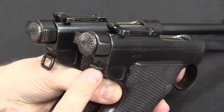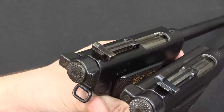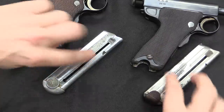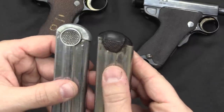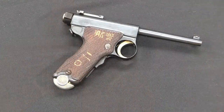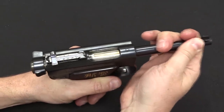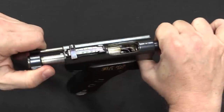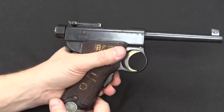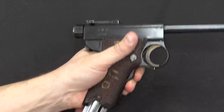These pistols all have lanyard loops. On the Grandpa it was a fixed lanyard staple, whereas on the Papa it now swivels, making it a little more flexible. The magazines were also changed — most distinctively, the Grandpas had a wooden base plate where the Papas have an aluminium base plate. The actual geometry of the magazine changed as well, and these are not interchangeable. Mechanically, the Nambu pistols are all locked breech, short recoil pistols. When you fire, the assembly reciprocates backwards to unlock the gun, and the bolt cycles similarly to a C96 in a few ways. These do lock open on an empty magazine, however when you remove the magazine the bolt drops home, because the only thing holding it open is the magazine.